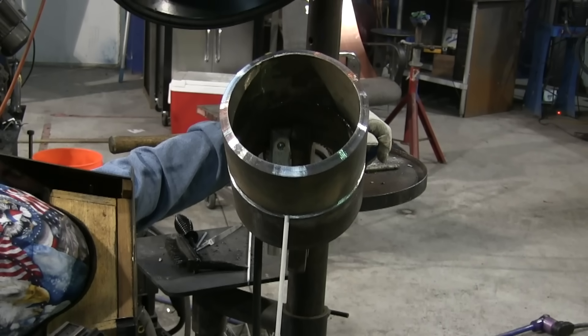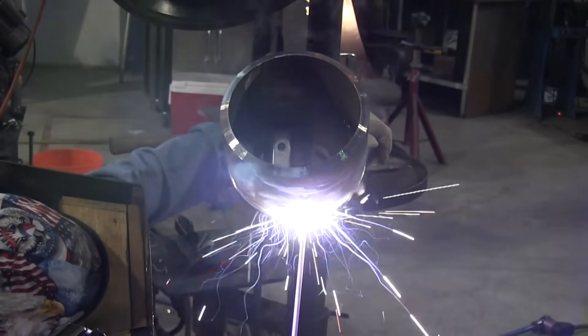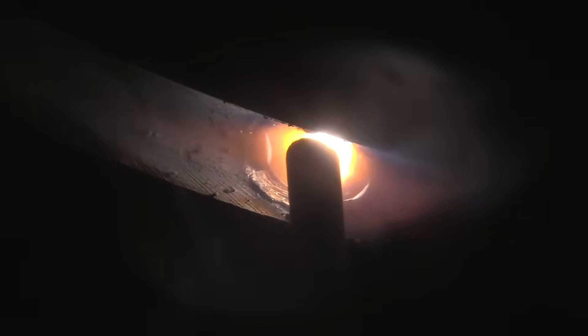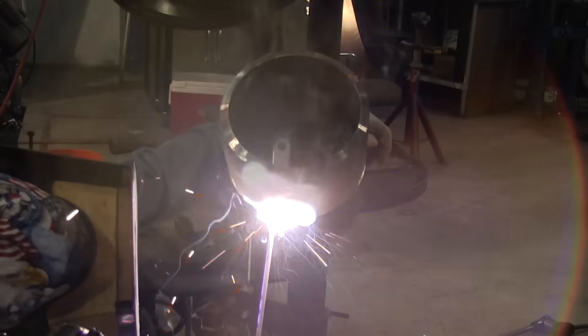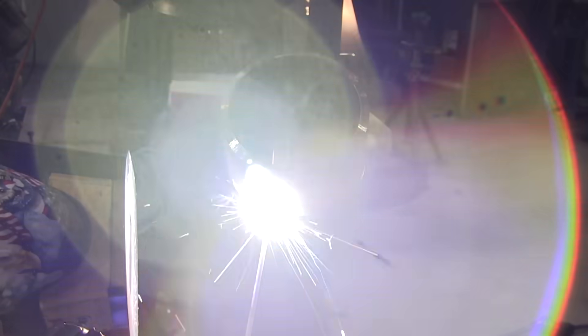This is my good friend Andrew Carden doing the welding today, and you'll notice he's pretty much going to be using one hand and propping with the other — swapping off between right-handed and left-handed welding. He strikes off ahead of where he wants to start, and then welds over top of all the arc strikes. You do not want any arc strikes outside of the bevel on a pipe test or even a production weld. On a test, arc strikes outside the bevel can be cause for failure, so keep all your arc strikes in there where you weld back over them.